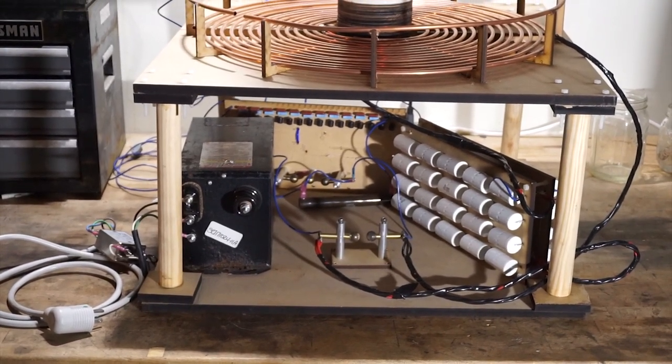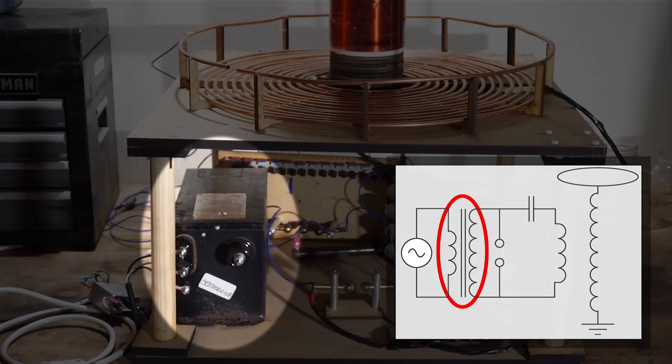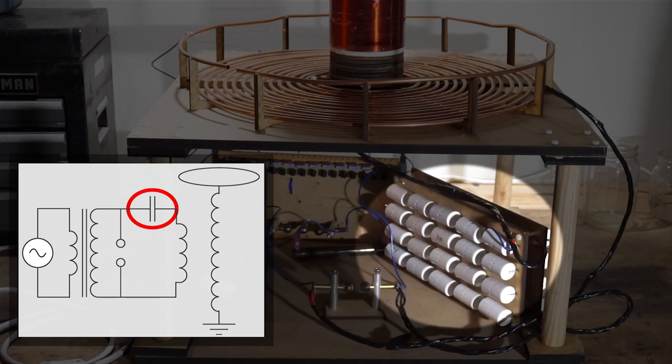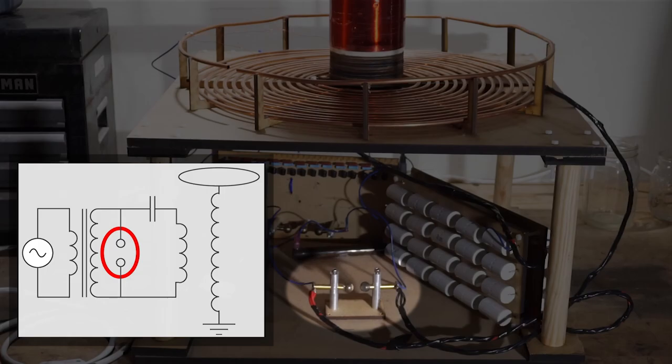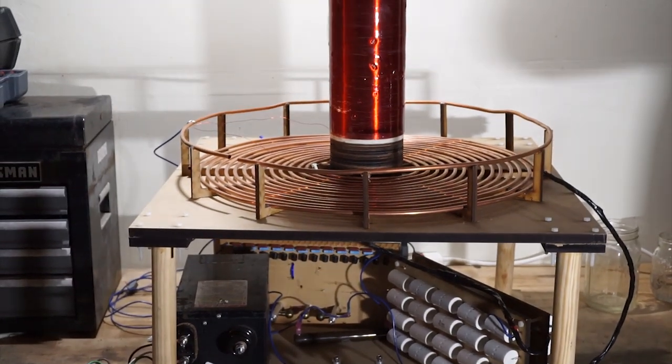It's powered off your household 120 volts. That feeds into the high voltage transformer, which charges up the primary capacitor bank up to about 15,000 volts. When that happens, the air in the spark gap breaks down, allowing all that energy from the capacitor to discharge